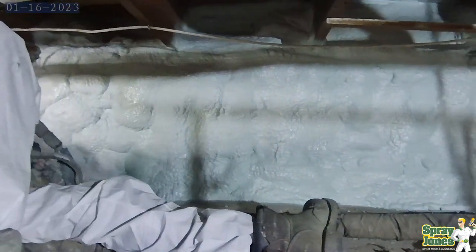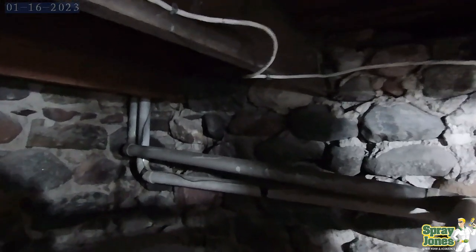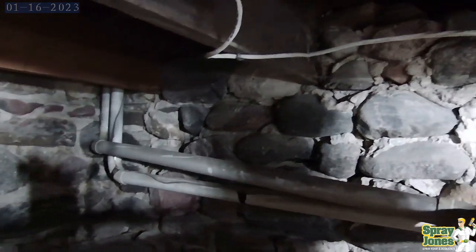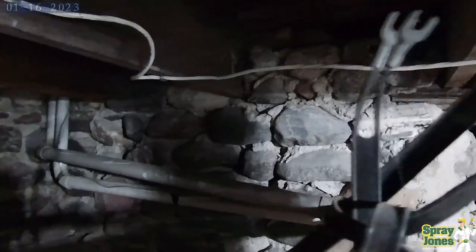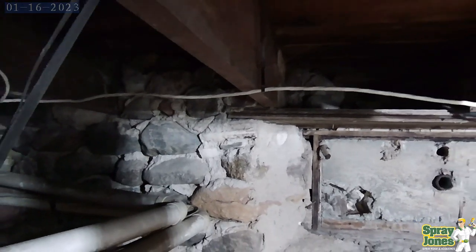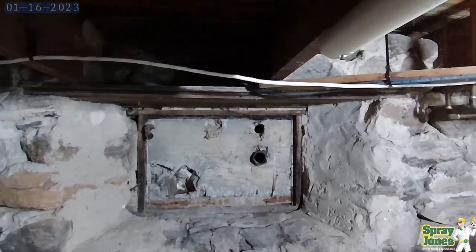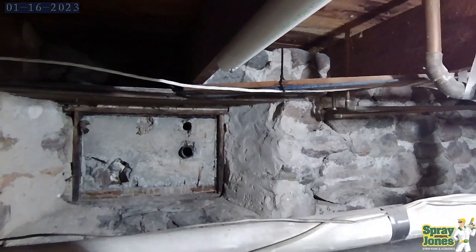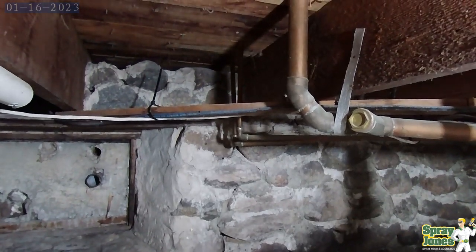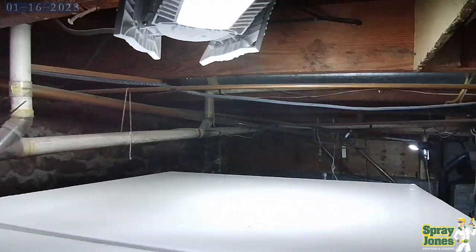If you're familiar, most homes nowadays have a poured concrete foundation. That's something that you would see from about the 1920s onward. In fact, from the 1920s, they would take the wood timbers that they use for floor joists, use them for the cribbing to build up the forms for the pour, and pour the foundation into it, break them all free, retaining them so that they weren't broken, and then use them for the floor joists. Prior to that, rubble and rock with mortar joints was what was used to provide some sort of a foundation to get the home started off the ground or slightly into the ground.